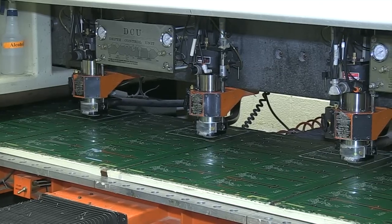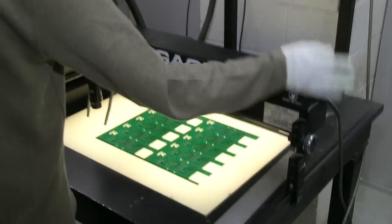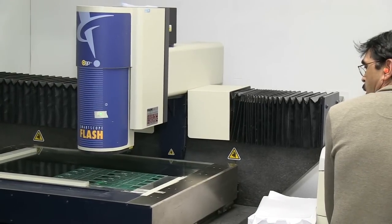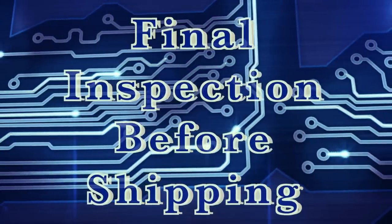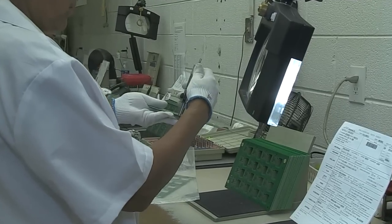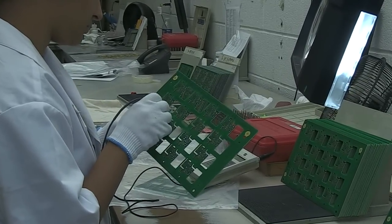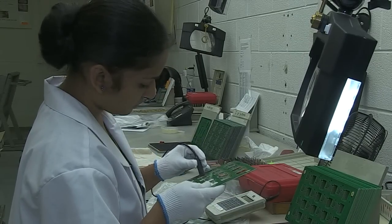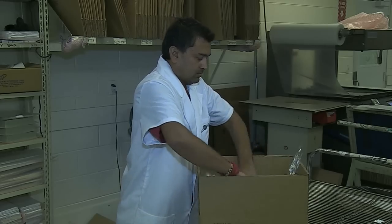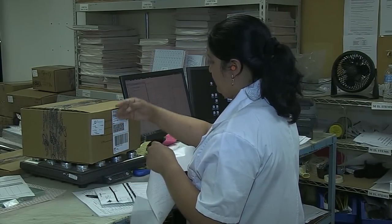In each fabrication process, the first piece dimensions are verified on a CMM machine against the customer's fabrication drawings. Once the dimensions are verified to be within customer specifications, the process is allowed to continue. In the last step of the process, Final Inspection Quality Control, a team of sharp-eyed inspectors give each PCB a final careful checkover. An inspector looks for any cosmetic defects like scratches, then measures the panel against the mechanical drawing, checking hole diameters with a tapered probe. If everything is okay, she prints out the production release note. After inspection, the PCBs are vacuum sealed to keep out dirt and moisture. They are then bubble wrapped, securely boxed, sealed, and shipped off to customers. The process is complete. We have followed our PCB from the customer's original design to the physical circuit board on its way to be assembled in the finished product.